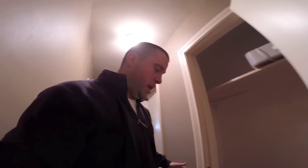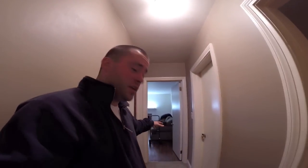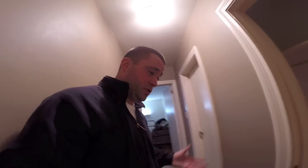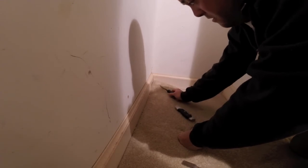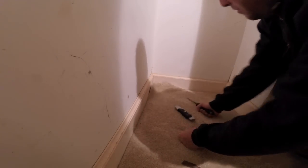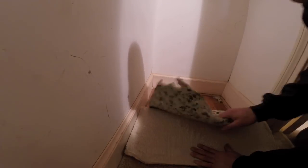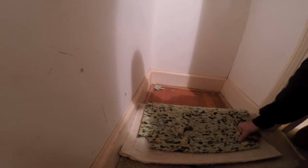When you're taking carpet out, you don't want to just rip into it and start cutting it up into pieces and taking it out. Just in case there was a piece of rotted wood underneath the carpet and they used some plywood to patch it over — then you go and rip all this carpet out and you've got a big spot that needs hardwood floor replaced, which is way more extensive. To make sure we've got hardwood floor, I'm going to go into a closet and just take a chisel and a utility knife, jab the chisel in there and pop it up. And I'm seeing beautiful — when I say beautiful, I mean beautiful hardwood flooring.